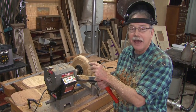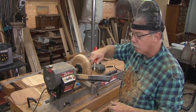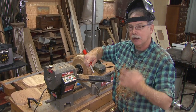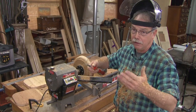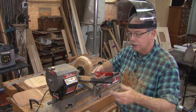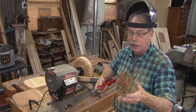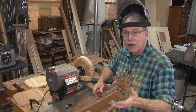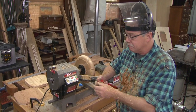Now with that delicate Allen, I've learned one thing. You clean off all the resin from the wood dust, because wood's only 3 things. It's lignin, which is glue. It's about 1/3 glue. It's extractives, which are the terpenes in this case that you can smell from the southern yellow pine. And it's cellulose, which gives it its strength. It's a skeletal frame of wood.